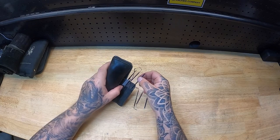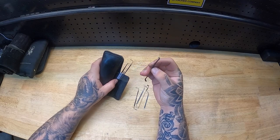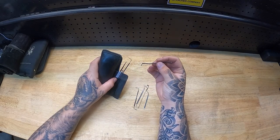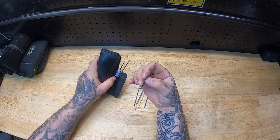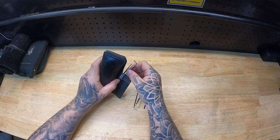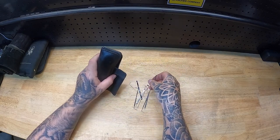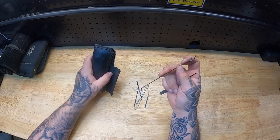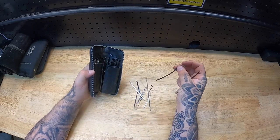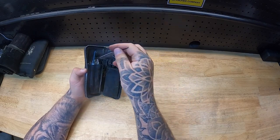I've got an array of tension wrenches — ones from different kits and ones I've modded and adapted to work for me. This one's all bent out of shape and typically that's probably one of my favorite tension wrenches. The good thing is you can just bend it and reshape it, and if you've got awkward door furniture to work around that's ideal. You've got a mixture of thick and thin, some that have got twists in them, some that are longer than others. Sometimes you've got to bend them into awkward shapes to work with what you're dealing with.